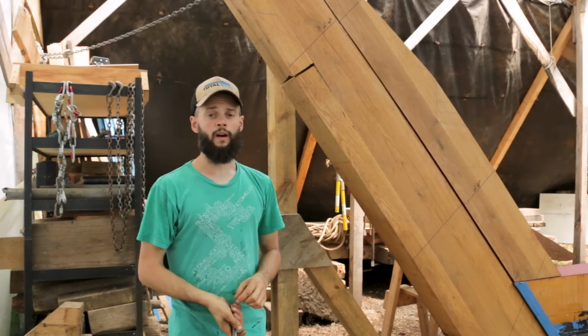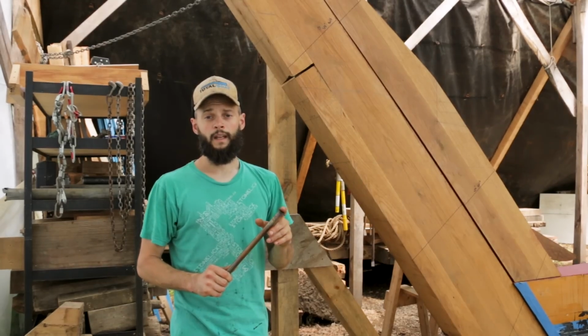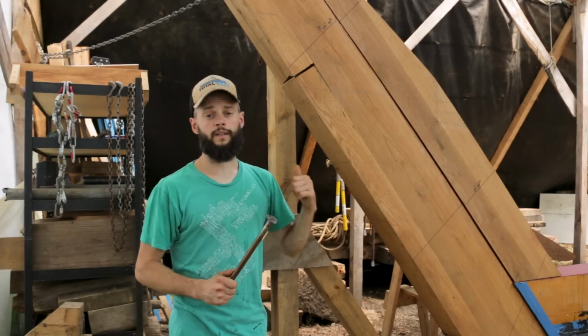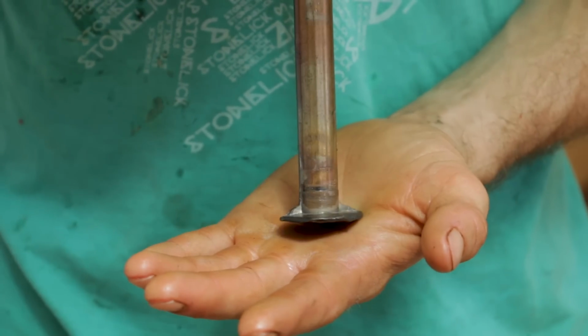So because of the bow, we need to make these things called fin head bolts, which are basically a homemade version of a carriage bolt. And since we had to make them for the bow anyways, we might as well use them for the stern and save ourselves some money, so we don't need a nut and a washer on the end that we use the fin heads for. This is a fin head bolt.